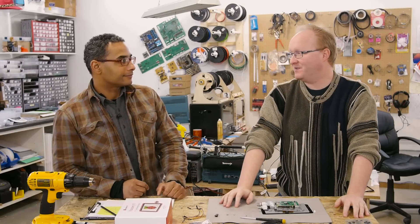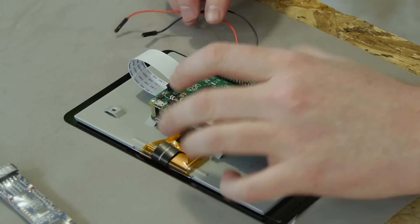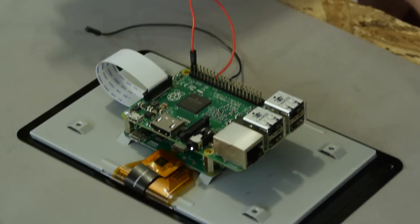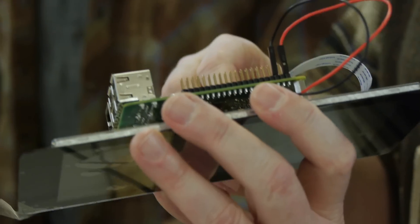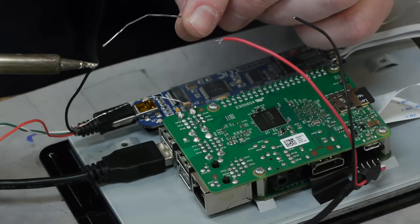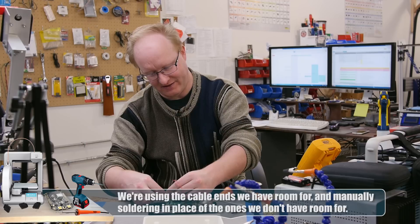Shall we boot this thing up? We need to power the screen with the GPIO — that's what the jumpers are for: five volts and ground. Five and then ground is the third pin. It's ready to boot. I pre-installed the Bitscope software. I cut off the USB cable so we have the plug going into the Bitscope, and I'm going to attach it directly to the USB connections on the Raspberry Pi, because we have enough room for this but not really for the cable. I'll just bring it over here and wire it up. The reason I have the cable in place is so I can double-check that the wiring is correct.